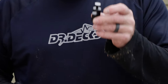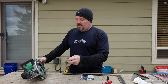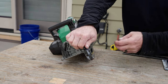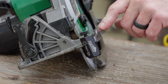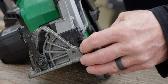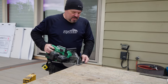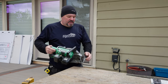And you're like, well, why is it so big? Well, Louie made it that way. So not only will it fit on a framing square for staircase layout, but it'll also fit on the front of your skill saw or chop saw. If you need to do some fine tuning or ripping of product, you can actually just clamp the Squijig onto the plate of your saw and give yourself a rip gauge. So you're not having to think — if you need to rip just a little bit or a lot, you can set it on like that and take a half an inch all the way down, just like that. Lickety split. That's a cool feature.